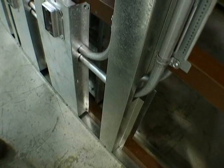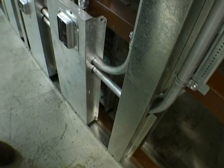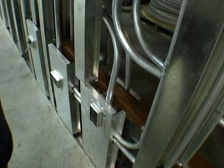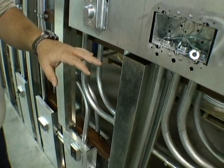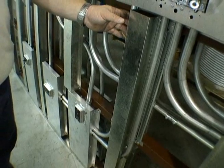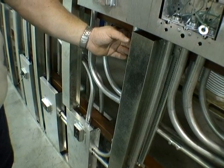One of the advantages of prefabbing — in our prototype, we had to punch all of our holes manually. But when we get into the production process, all of our openings and holes will be pre-punched at the time that these pieces are formed on the computerized punch press.